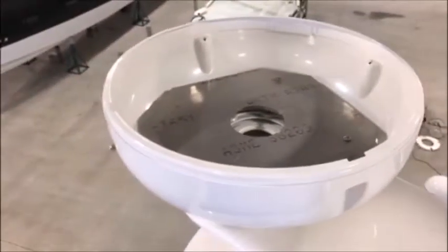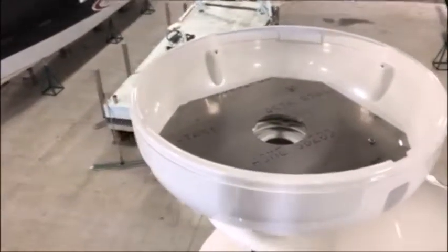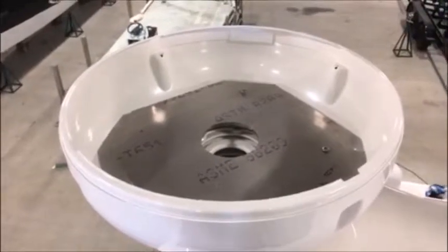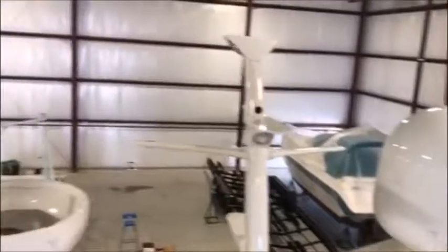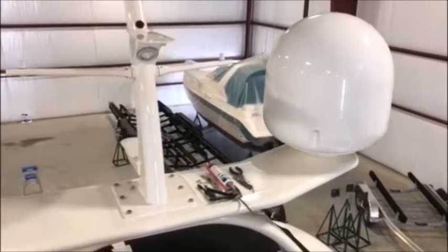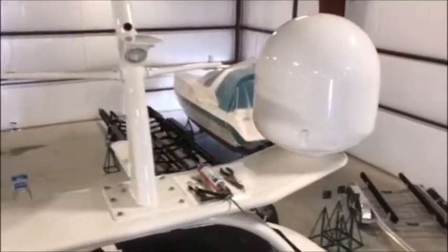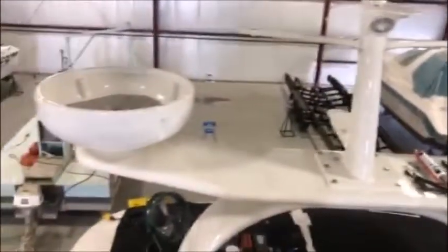This boat is going into salt water, so it can't be anything ferrous that might corrode, so we're using 3/8-inch aluminum. As you can see, I've cut that and I'm in the process of fitting it into the dummy dome so that the V-SAT can go inside. Things are going well here — it's a process. We should be off the hardtop here shortly because our scope of the project is the satellite TV, satellite internet, and satellite phone components. Just wanted to stop in and show you how things look. Thank you very much.